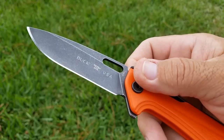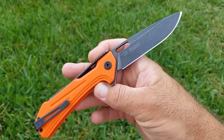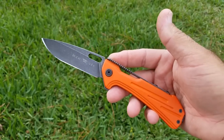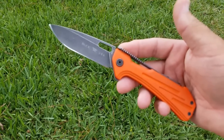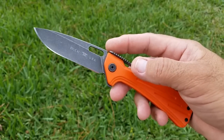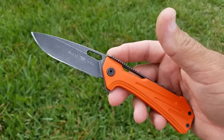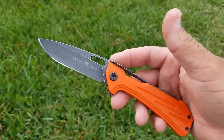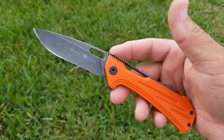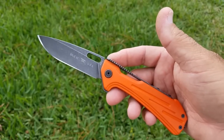Same as always, 15 degrees per side, 1500 grit finish, strapped on 6 micron, 3 micron, then 1 micron, 5 passes per side. On the first test, and I know Kenny from In the Pocket sharpened this once before I did. I sharpened it 3 more times before I did any testing on it. The first time I tested it, it did 116.6 feet fine edge, which is pretty good. The fine edge was a little bit better than some of the other S35 I tested production wise.